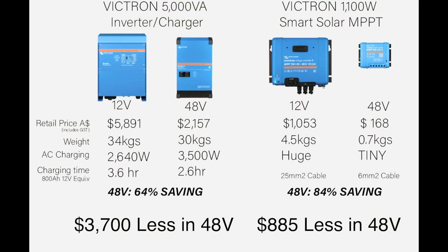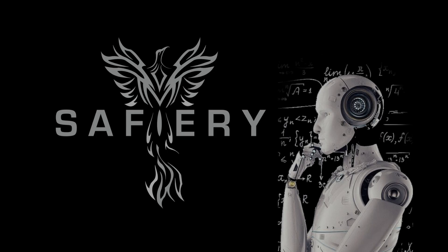While we're watching this video, let's show you the pricing from Victron in 48 volt — it's quite remarkable. You'll see a 64% to 80% saving depending on whether you're running solar or an inverter charger. The 48-volt system runs at such a low current compared to 12-volt, and power electronics are priced based on current. Cut the current to one-quarter and the user gets a huge saving in 48 volt. People that use it say it's an absolute no-brainer.